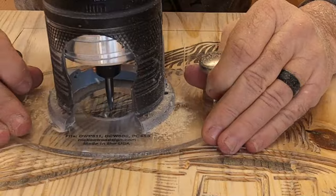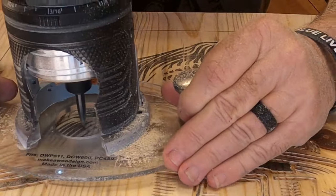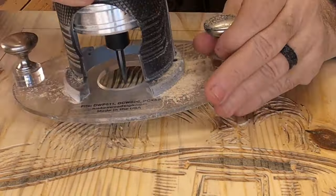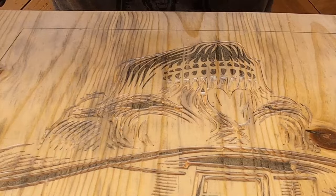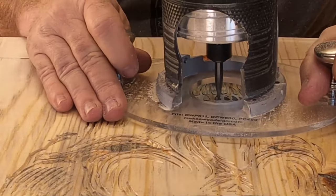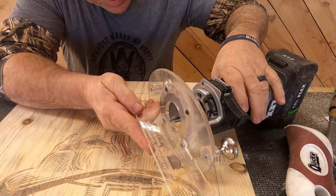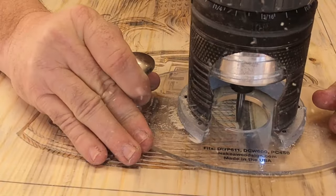It gives you a reference to go back and double check to make sure that you're carving all the lines you need to carve. I've done it before where I carved something I wasn't supposed to and that is really frustrating - you spend an hour trying to figure out a way to save it and end up burning it anyway and starting over. So just print out a picture of what you're supposed to be carving. Another important tip, especially if you've never carved something before and maybe have a grainy board or really fine lines: starting shallow and then going back deeper is going to help you out a lot. You're taking out less wood so it really helps you keep a straighter line and get finer points.